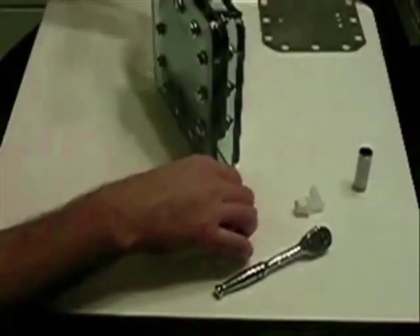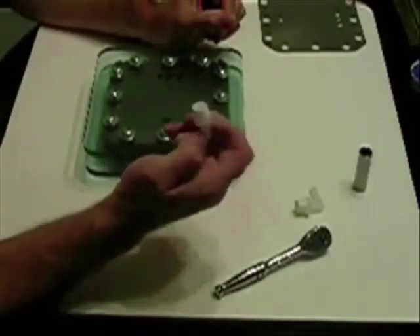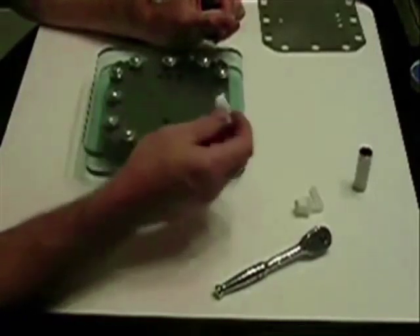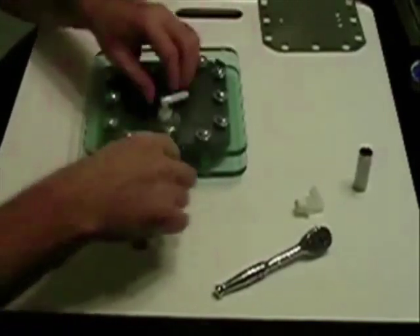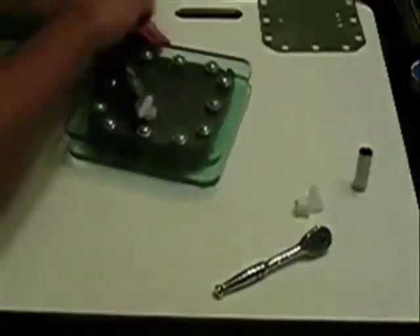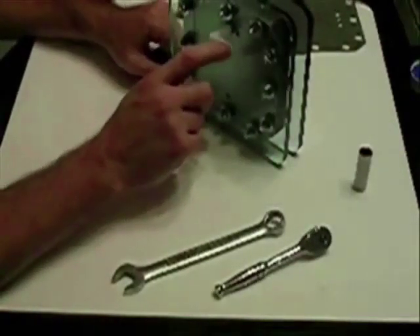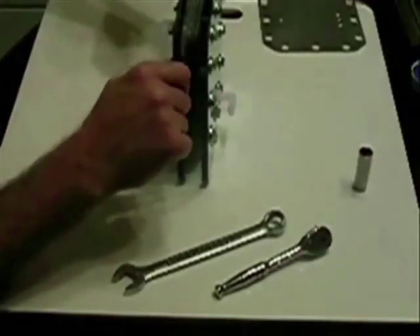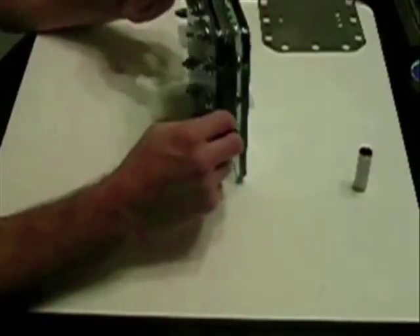I've already taken the liberty of putting Teflon tape on these fittings — I think it's a half inch. I tapped it out and it should go in there no problem. Once you put the Teflon tape on there, use a trusty Craftsman 5/8 wrench. This fitting at the top is where the gas will come out, and this is the end that will go out to your bubbler. These connections here — you can choose hot/negative, hot/negative, or you can have your neutrals in here. By playing around with these setups you'll get different production. Your electrolyte is going to make a big difference, but have fun and be careful.